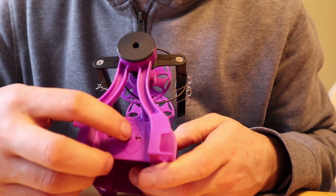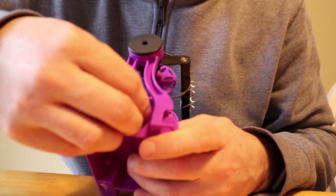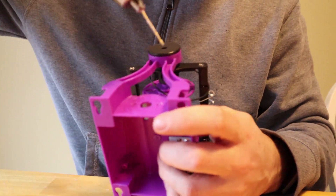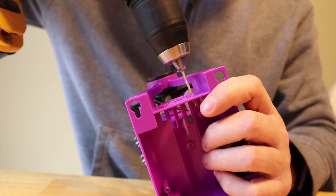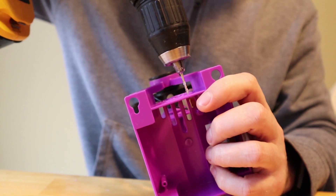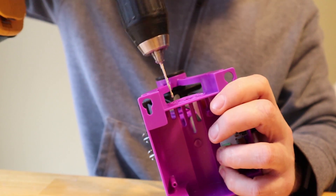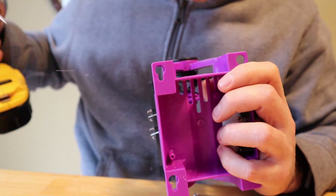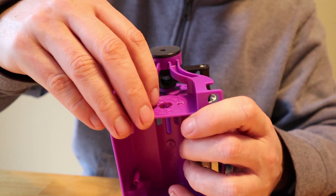At this point I have two little slots, but the screws don't quite fit all the way into the slots. That's pretty normal — it's because I picked a smaller drill size. So what I do is just enlarge the hole. You could either get another drill that's a little bit bigger, or what I tend to do is just enlarge the hole by rubbing it back and forth with the drill to kind of widen the slot. And that's much better — now the screws will be able to fit into the slots and we should be good.